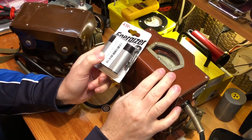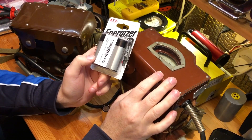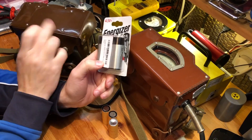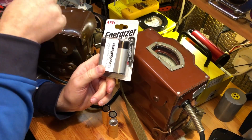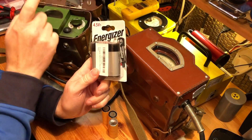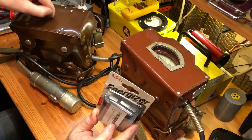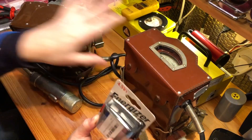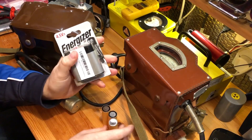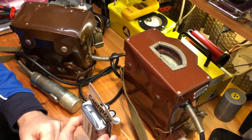I power this meter with just standard AA batteries. This is a DP5A and I literally power it with standard AA batteries which I have made adapters for. I've done the same thing with the DP5V — I made a couple of 1.5 volt AA battery adapters and just drop the AA batteries into it. I've also put in a slightly larger battery because I have upgraded the bulbs in this to be slightly brighter, which I will show you in a minute. In this video we'll show the batteries in the DP5V and then cut the LR12 open on camera to show how to extract the three cells.